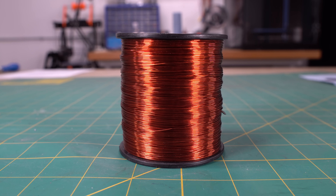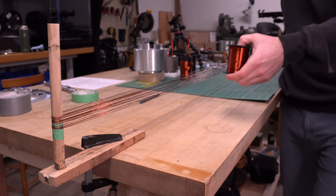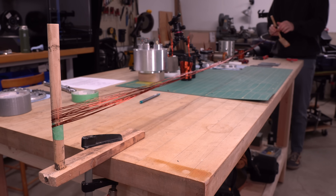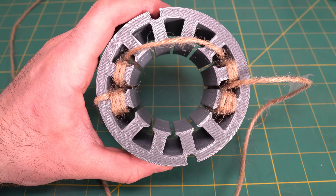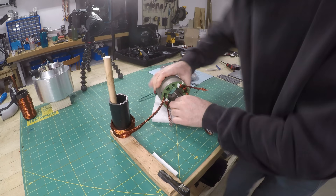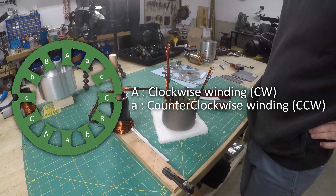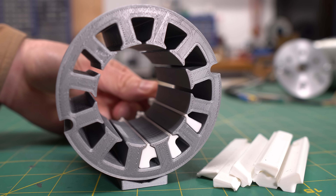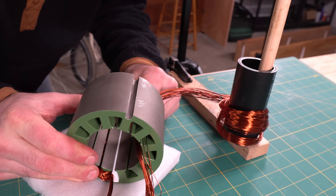The next step was the winding process. I purchased a spool of 24 gauge magnet wire with a temperature rating of 200 degrees Celsius. Because I needed each phase to consist of 33 strands, I first had to create a spool of wire for each phase. I determined the length required by winding a string through the stator to represent one phase. After making my spools of wire, I began winding the stator with the same pattern as the brushless DC motor. I also 3D printed jigs of three different sizes that slide into the stator slots to secure the wire in place and compress them to leave space for subsequent turns.